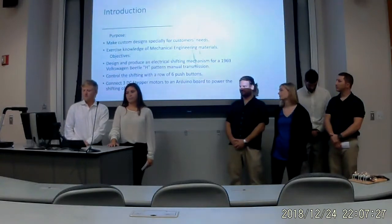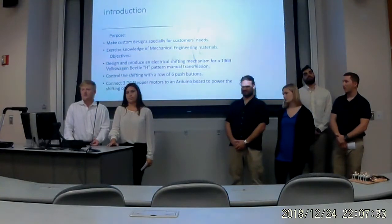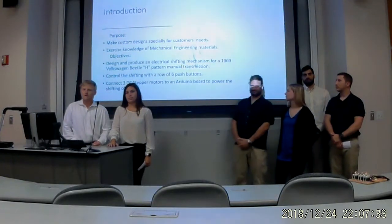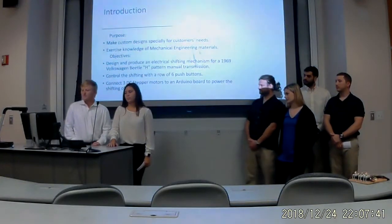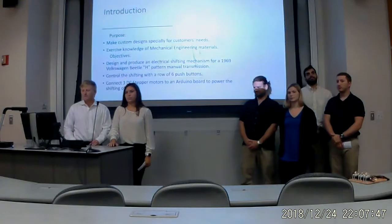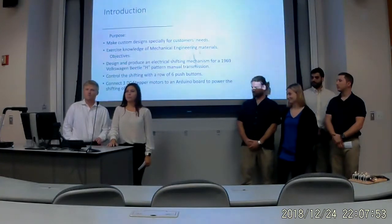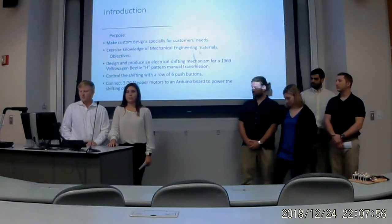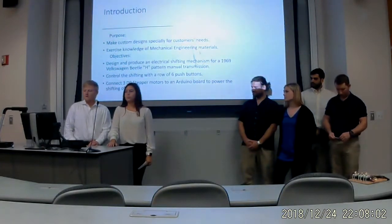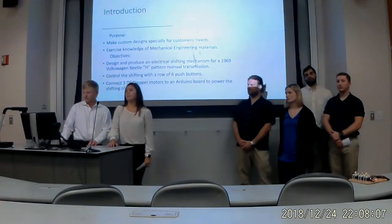Our goal is to make a custom design part, especially for our customers' needs, and in this case is Mr. Carlson. And we're going to use the knowledge that we've learned over the past 4 years in the school to get that done. And it's to design and produce an electrical shifting mechanism for a 1969 Volkswagen Beetle transaxle with an H-pattern manual transmission. And we're going to control this with a row of 6 push buttons, and we're going to connect 3 DC stepper motors to the Arduino board to power the shifting of the gears, and this will be through rotational and linear motion. We'll get more into that later.